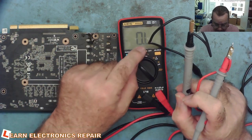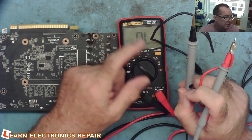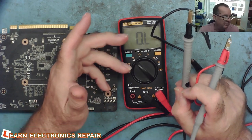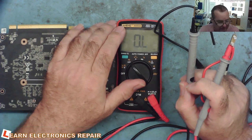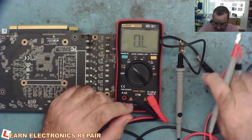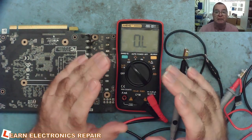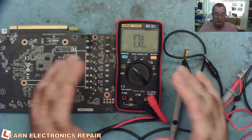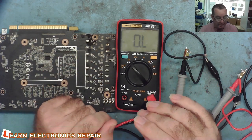The resolution of this device — which is 0.001 millivolts — is equivalent to 20 micro ohms. That's the resolution of this meter. And you've just seen it working very well. The video where I demonstrated this has about a hundred thousand views now — it's my most, or one of my most, viewed videos ever.